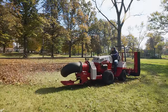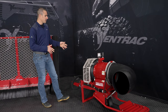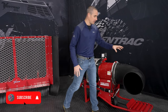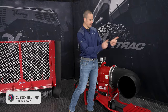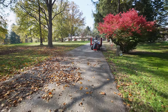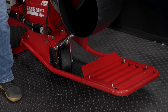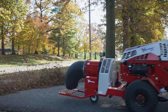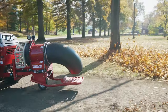It's a little bigger of a machine too — the physical footprint is probably three times the size. It's PTO driven as well, and the inlet here is the gray part of the turbine, with an actual turbine housing, and the outlet is where the air comes out. This rotates 360 degrees on a different plane than the power blower — it rotates left and right, and you can point it straight up in the air or straight down at the ground. Pointing it straight down is a nice advantage because of the louvers on the front of the attachment, which catch the wind and direct it directly forward with a good amount of force. Typically you'll run it aimed left or right at about a 45-degree angle down at the ground, which really collects those leaves and sends them out as hard as possible.